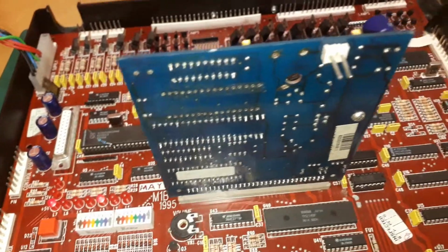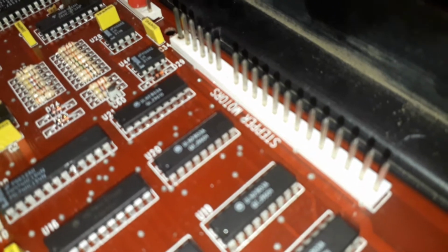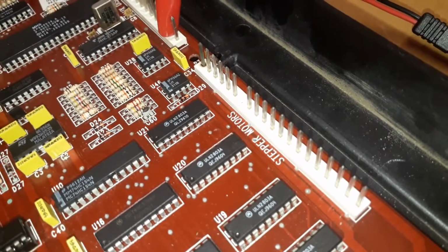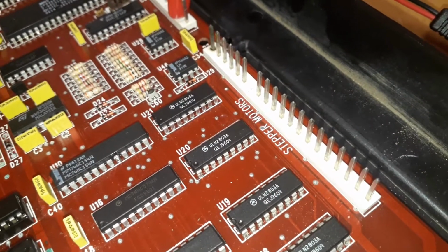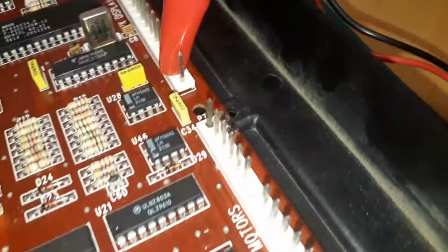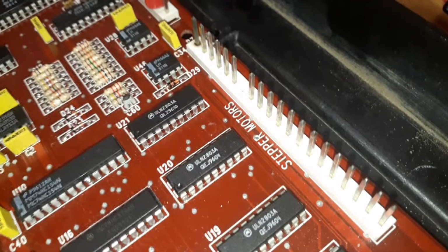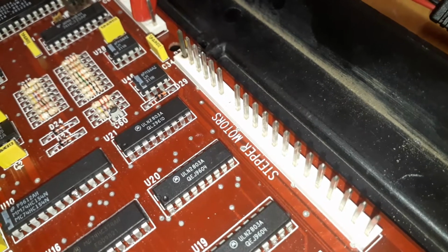What we need to deal with now, I'm still a bit apprehensive about doing this because I'll need to somehow prise that plastic off and then deal with it a pin at a time. The only issue left is that. Need to fix that plug. Could take it off a scrap Maygay board, I suppose, but it's what's been damaged on the traces underneath, and you see the corner of the board burnt there. Maybe the best thing to do with that is just leave it and use the separate lead-in cable that you were using. I don't know.